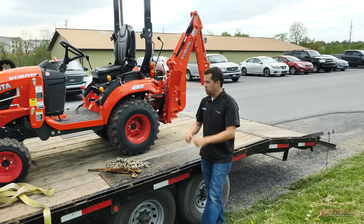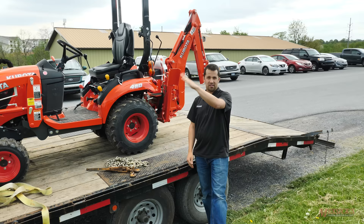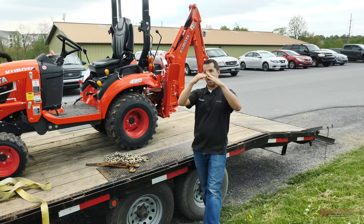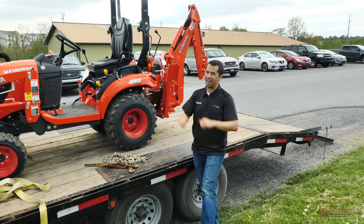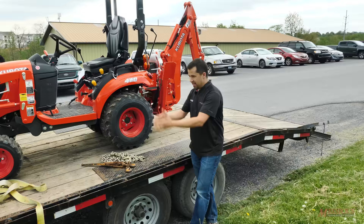One thing to watch is when you back your tractor off — be mindful of how your tongue weight is changing. With this actual truck and trailer, I was parked on a slope in a customer's driveway and when I backed my tractor off the back of the trailer, I went onto the ramps and lifted that tongue weight up, taking enough weight off the back tires of my truck that the entire thing started sliding backwards down the hill. I was fortunate enough to be quick on the hydrostat and got off fast and got the truck back on the ground. Your tongue weight is not just set for trailering down the road — think about what happens when you're backing the tractor off.